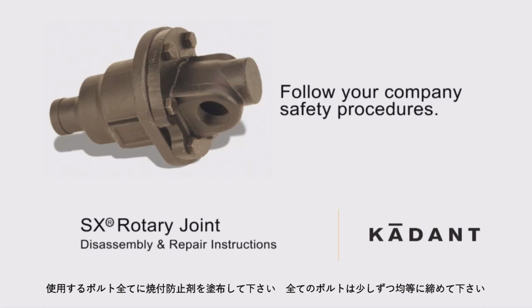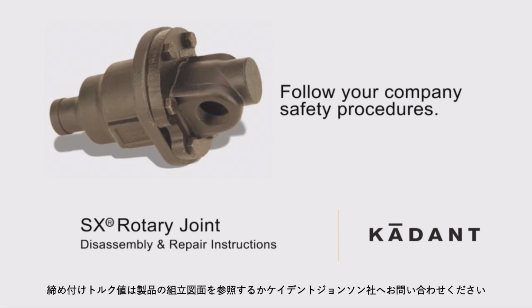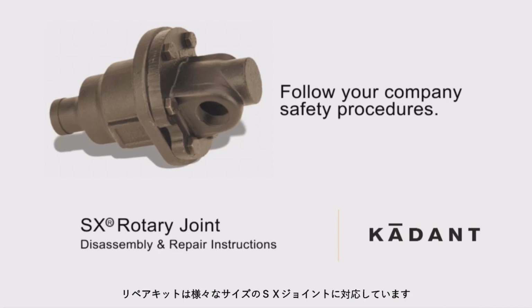Lubricate all fasteners with anti-seize compound. Tighten all fasteners in a star pattern. Torque specifications are listed on the product assembly drawing and are available from Kadant Johnson. Note: repair kits are available for the various sizes of SX rotary joints you have.